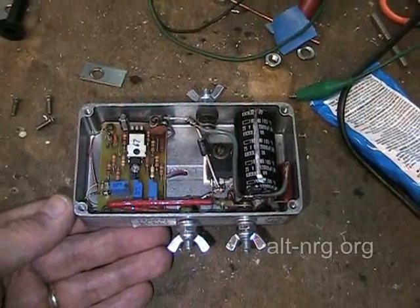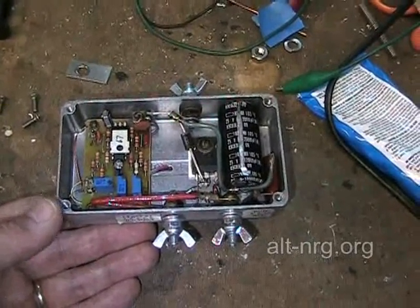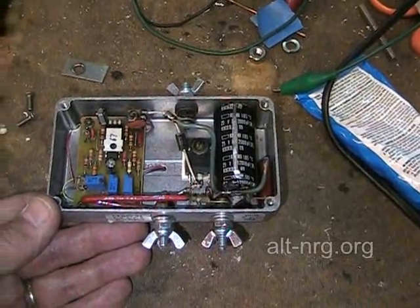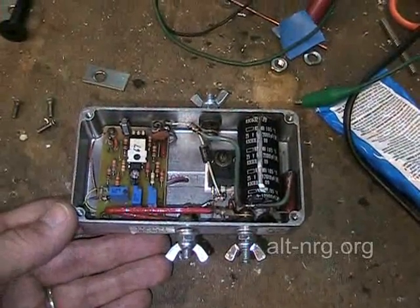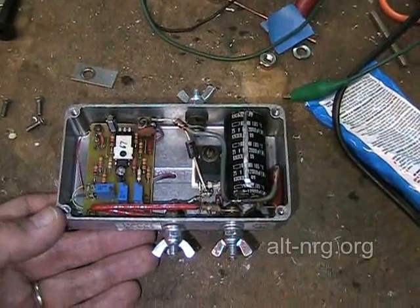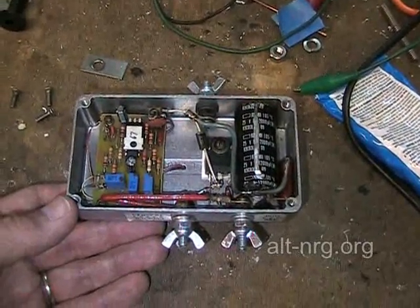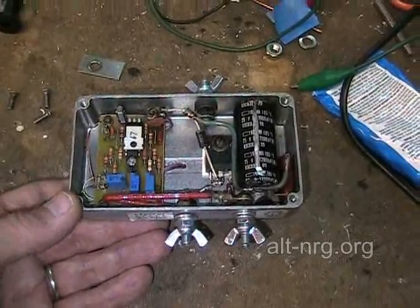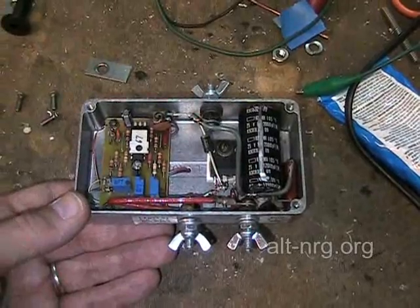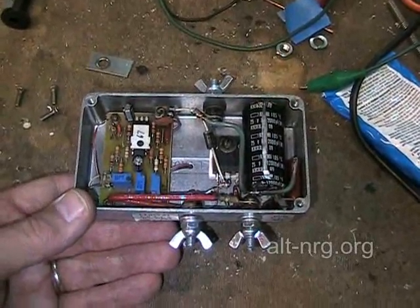It does not help that the design of the cell that this was attached to was a parallel plate design, meaning the plates were oriented and connected plus-minus, plus-minus, plus-minus, and so on — no neutral plates at all. The peak impulse current on a cell design like that can easily go off the map very quickly if the electrolyte is allowed to get too strong.